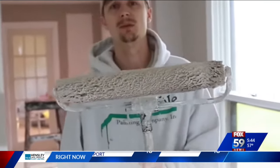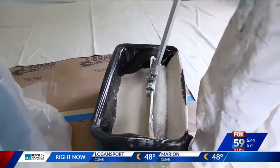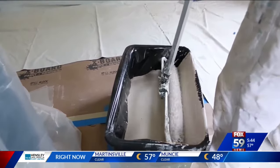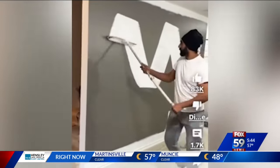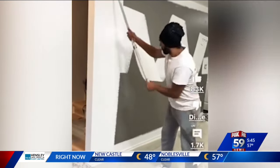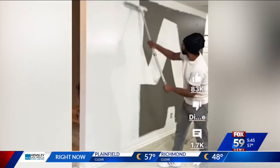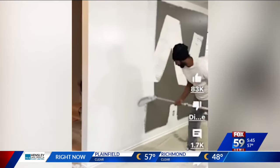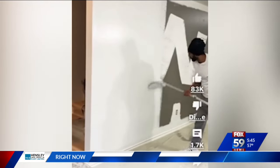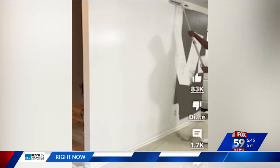You'll also have to buy the two-sided cage that holds the 18-inch roller and the wide paint bucket made for it — it is more expensive. But watch how fast you can go. You dunk the roller into the paint, which puts a lot on the wall all at once, then spread it out. This is the method I've used but never videotaped. This guy did it — he was done in seconds. Literally. Your time will vary. Plus it makes coverage much more even.